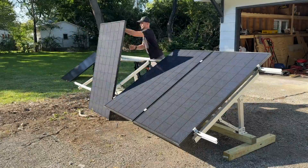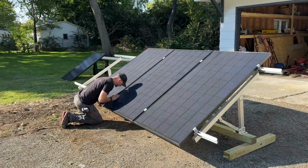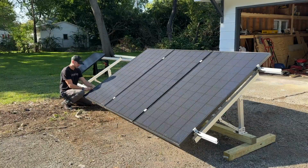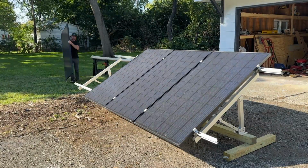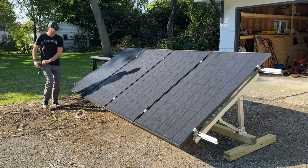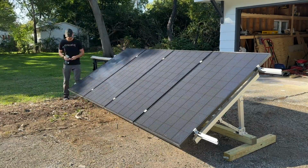So make sure those are underneath your panels, and then that's what's going to connect the ground as we attach a ground wire to the top rail and the bottom rail. And then all those different grounding clips will tie everything together. So just finish up here with our last panel and we'll be done.